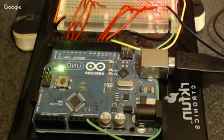When you do go out and search Arduino, there are so many things that people are coming up with these days to power them. It's unbelievable. An Arduino of this size is going to take a fairly decent amount of current to run the microcontroller that's on there, and to supply current for the output pins and all that stuff. So you definitely want to make sure that you have a power supply that can handle the current it's going to need to deliver. But when we talk about smaller Arduinos, they probably won't draw as much current, so you could probably run those off of batteries with no problems.